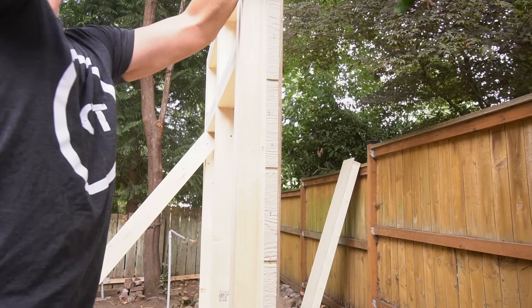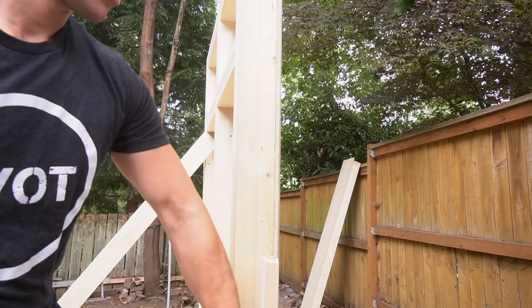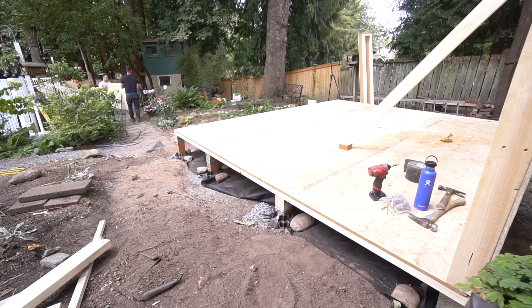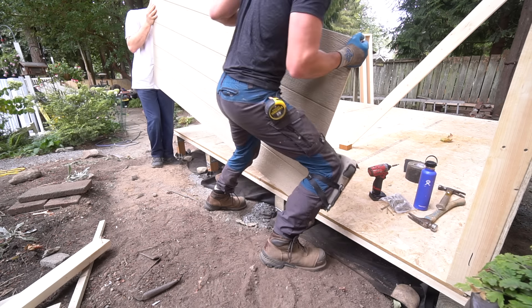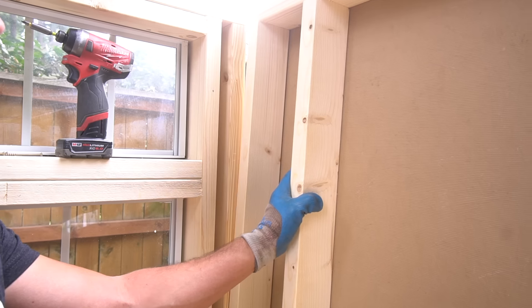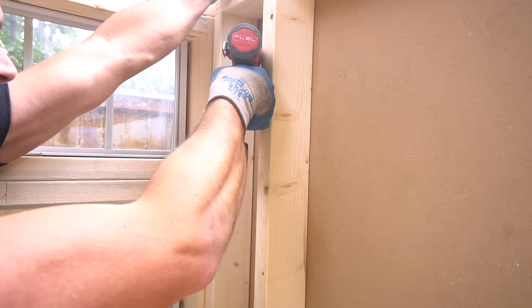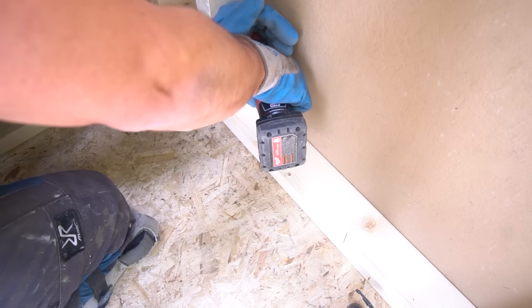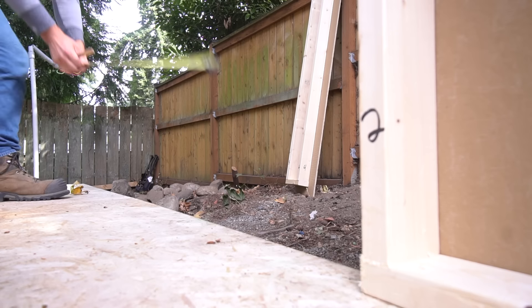All of our panels have a lip lap siding, and they actually protect that lip during shipping with this type of product. These are just small pieces of siding that they cut down and stapled in place, which is why it's very easy to remove once you have it installed. In order to provide our first wall with a bit more stability, I grab the last panel — which is easy to figure out because it's the one with the highest numbers at the bottom — and secure that to the adjacent wall. Once I fasten both walls together, I then secure the base plate to the floor joist, which provides an extremely stable and durable wall corner.